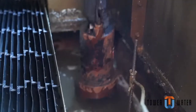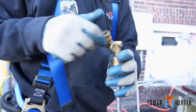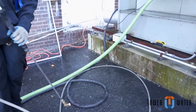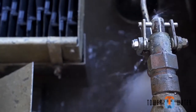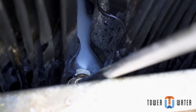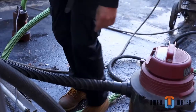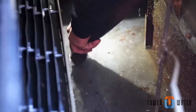Add the sump pump to the tower so that we can suck out the debris from the basin. Put the sump pump in a low spot of the basin or an area where all dirt accumulates, and double check that the pressure washer is set up correctly. Turn on the makeup water, drain, and begin pushing the debris from the outside basin to the inside while your partner directs debris to the sump pump. Notice the protective mask keeping water droplets out of your lungs. Use the vacuum to get the areas the sump pump won't reach and pick up the heavy metal flakes and debris.